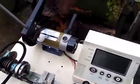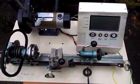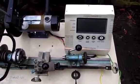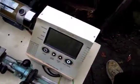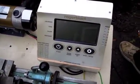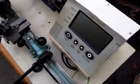It doesn't even have to be anywhere near the lathe — it's not in any way attached to the lathe. But I thought I'd try it there to see how it looks. I'm now going to plug it in and turn it on. I hope I've got the wiring right. But the advantage of using the control panel from the treadmill is you have a virtual no-volt release switch — it should just stop if the power comes off. That's the whole point of the safety features.